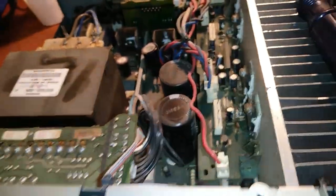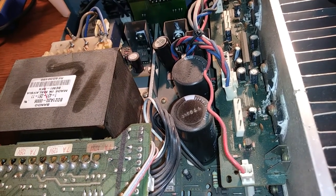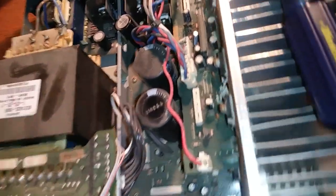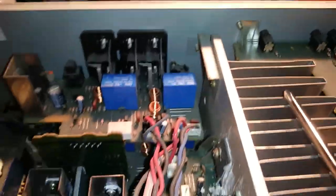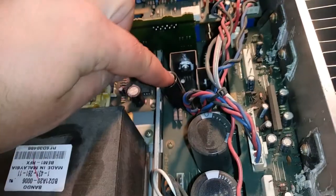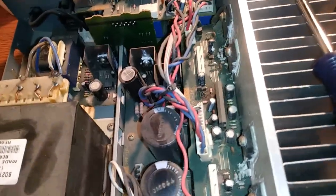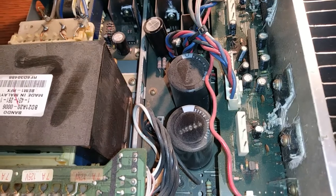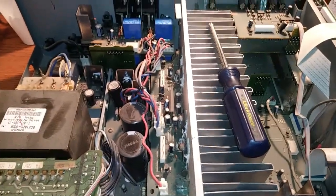If the reflow doesn't fix the screen, we'll dive into it further. The main issue is going to be the sound end of it, and I'll be able to diagnose that better once I have known good speakers. I don't think the speakers were the issue though - that wouldn't be intermittent. It looks like probably this board down here is what I need to get at based on the speaker inputs on the back. These top surround sound ones are still a daughter board off of this main speaker output board, and it looks kind of hairy to be honest - a lot of stuff in the way.